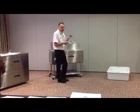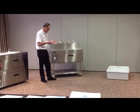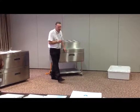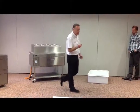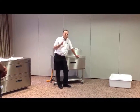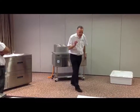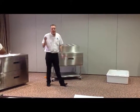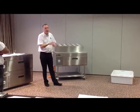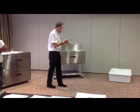What George and I did when we came into this business to start off with — bearing in mind that we knew nothing about it whatsoever — was we asked a few questions about what typically fails on a food service refrigerator. And the first thing everybody mentions is compressors fail. And George and I looked at each other and thought: compressors fail? They are the most reliable bits of kit that we'd worked with over 20 to 30 years in the oil and gas industry. When we dug down a little bit deeper, it's not the compressors that are the cause of the failure — it's the condensers. The condensers are getting clogged, the heat isn't getting rejected from the condenser, which causes the compressor to overheat. The compressor fails.